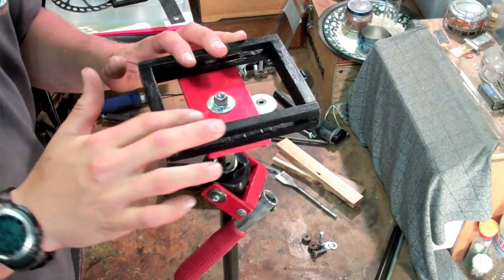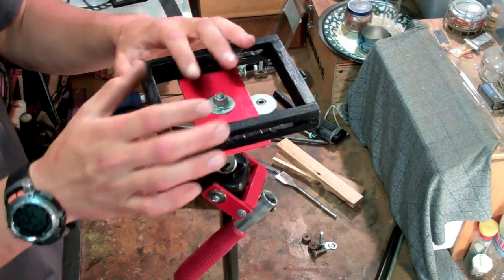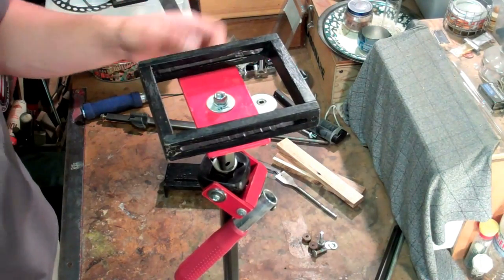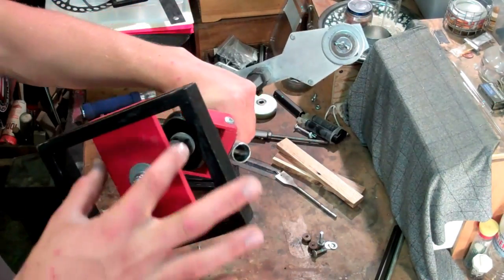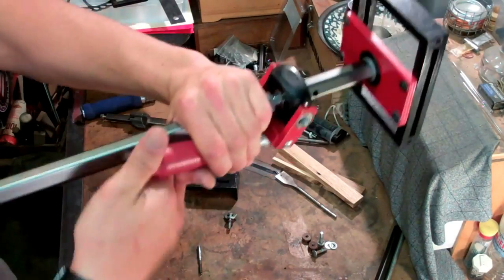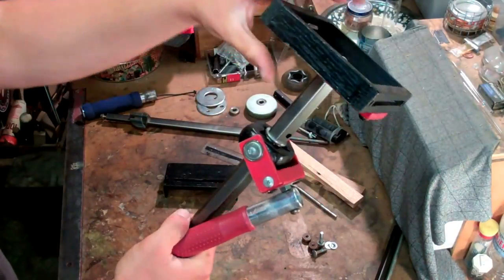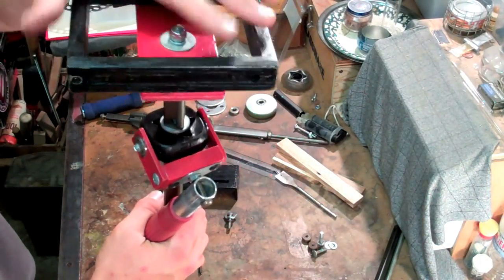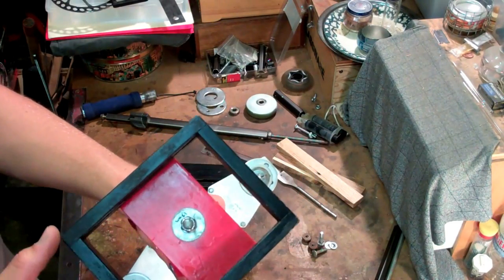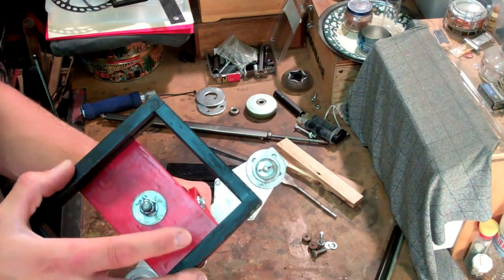The top part is called the platform, where you actually mount your camera and adjust it left and right, and forwards and backwards. I started with a little piece of plywood about three inches wide, attached through big washers to the bolt on the shaft. The actual platform I made as a small wooden frame about five inches wide by six inches — you can make it as large as you want as long as your camera fits.